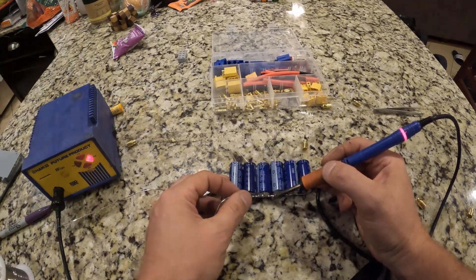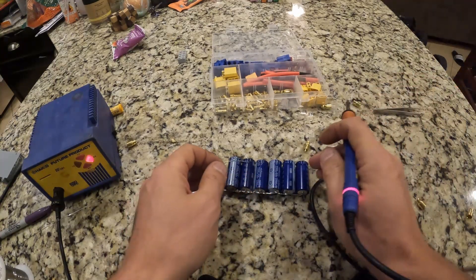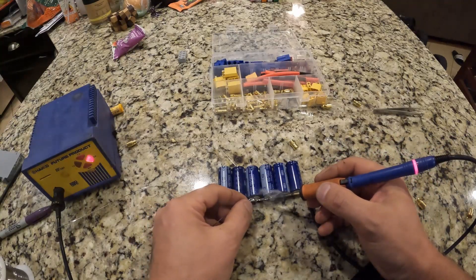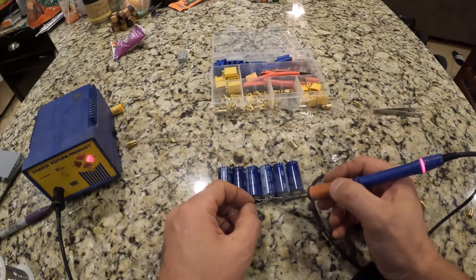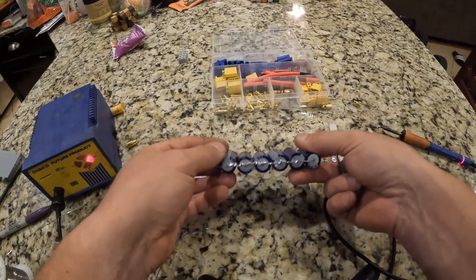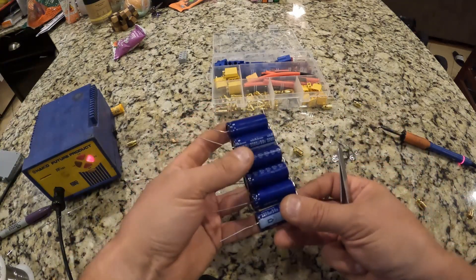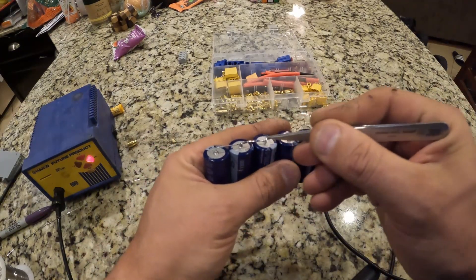I do want to point out something: when you make this, there is no protection in here. Very much like a lot of RC stuff — some batteries have protection in them, some don't — but these right here have no protection. So if something happens and there's a dead short inside this, it will blow up. It can cause a fire because there's a lot of energy in here and a lot of energy coming in from the battery. If this gets shorted, it's going to burn up. So you guys have got to be very careful. But this side right now is done — all of these are connected together.